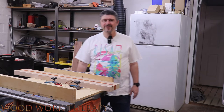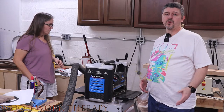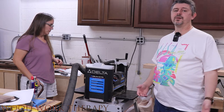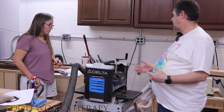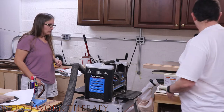We'll go with that. All right, here we go. All right, so now we're gonna go ahead and plane down the board. Like I said, you could do sanding and level it out, and that would work just as fine, or just a hand planer if you have one. But in this case, we're gonna use the electric planer because, well, we have one and it's faster, so that's what we're doing.